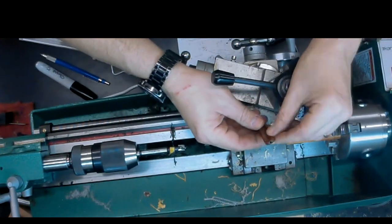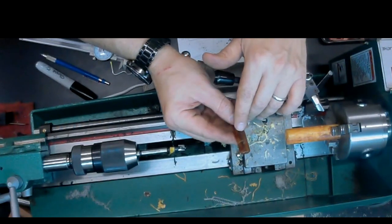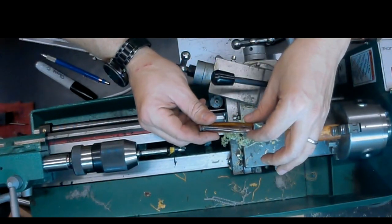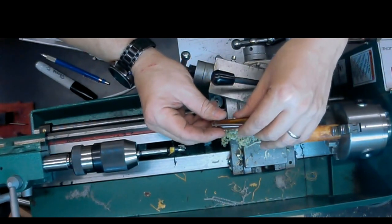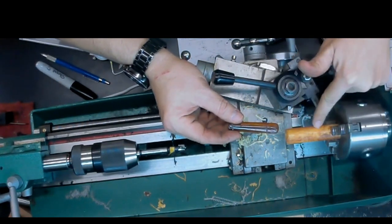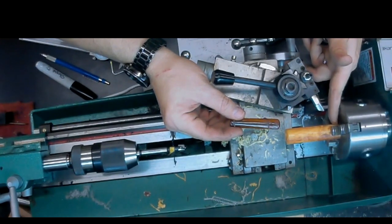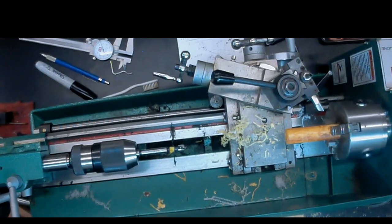And we haven't really talked about the design of the stem, but this is an old style stem, just a round hole in the end. We're going to modernize this a bit, put a little flare out into the button, and thin it out quite a bit. So if we cut down to about this point, we'll have the remainder for flaring out that button area.